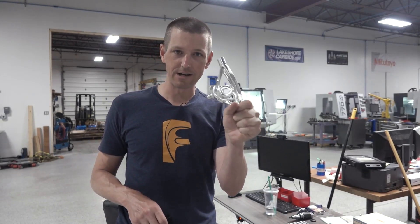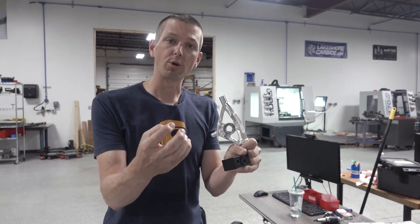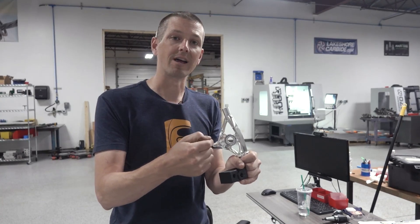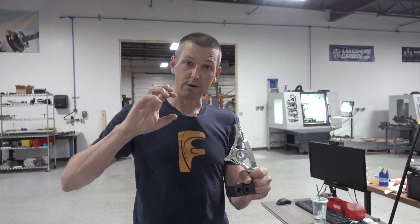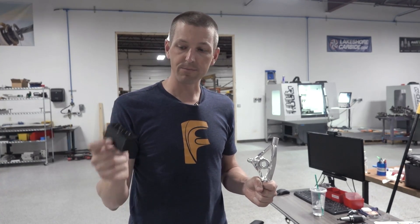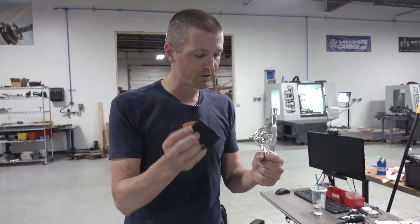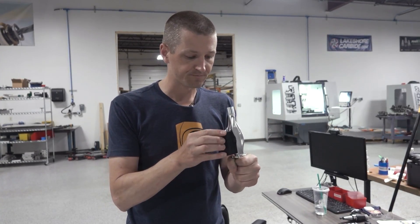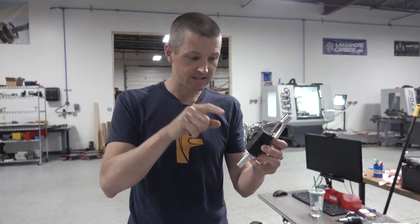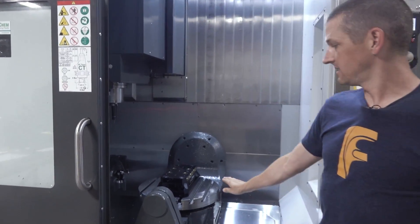This one's cool — a super complicated part. When I was done with op 1 I still had a giant chunk of material at the bottom and no good datums left. I had this idea, courtesy of Rob Lockwood, to bolt on some material. Once that material was bolted on, still in my op 1 setup, I could machine a feature into the part that would give me good datums to use when I rotated into op 2. We'll have a whole video on this workflow, but I wanted to test the idea first. So we quickly 3D printed this fixture — it's got a boss that locates into this ring and a couple of clearance pieces to handle the very strange nature of this generative design part. Sure enough that told me it's going to work great. Very little time on the front end, 3D printed it, saw the couple of changes I wanted to make, then we machined the real version.